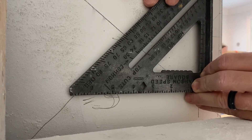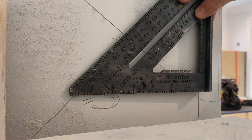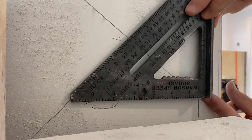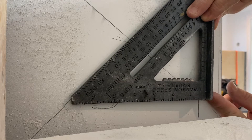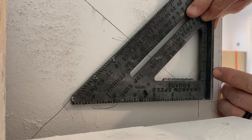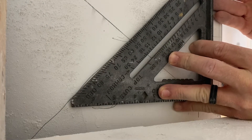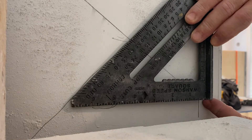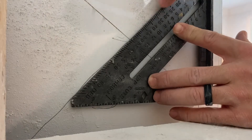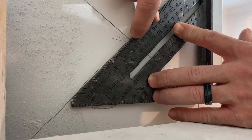There's my wife and my little girl in the background — hi, baby girl. So I got it perfectly lined up on the line, and I'm going to slide this down. This is what's called the pivot point. I'm going to slide that down to get it right on the pivot point. On the other side of my speed square, that edge is lined up with the line — not this edge, that edge. I got it perfectly at the bottom, got it perfect at the top, right at my intersection point. I have it all lined up. This is perfectly plumb.